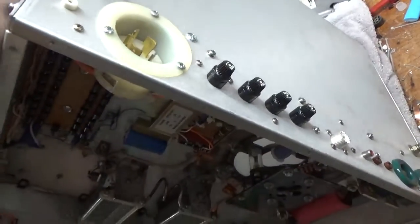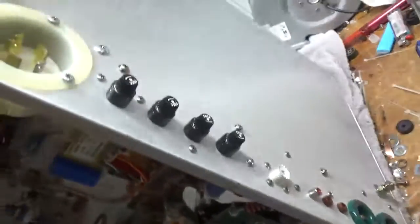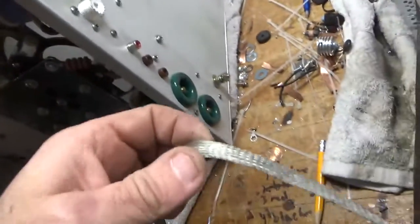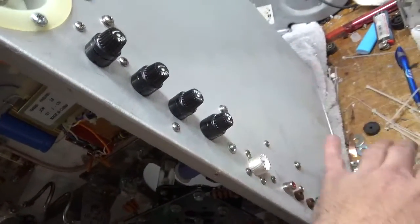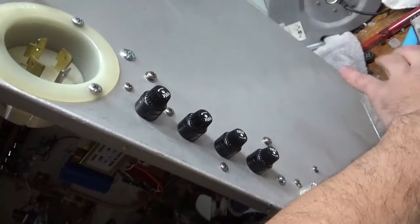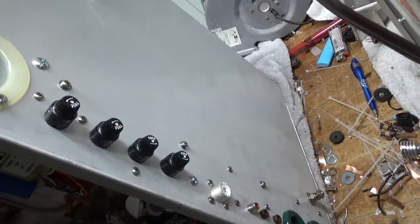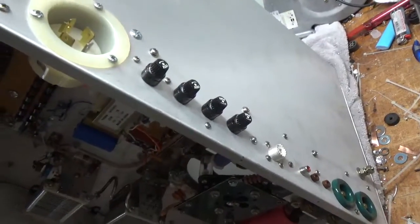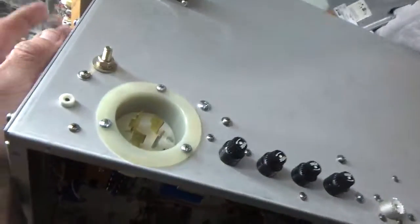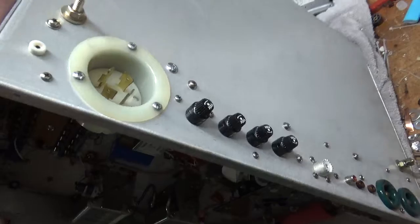The B-positive will be within a braided ground strap running down the center through a grommet, with a pigtail and ring terminal connecting to ground on the inside for strain relief, plus it'll protect the high-voltage cable. It's going to be hardwired on this side, going to a standoff, and from the standoff to the base of the plate choke. On the other side, the person has to take the cover off and insert it — I didn't want to use any high-voltage connector since this is the most dangerous part.